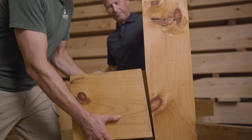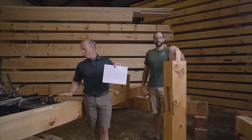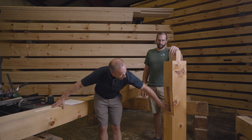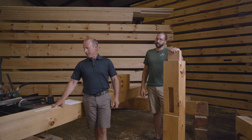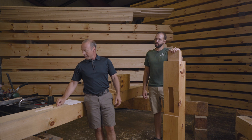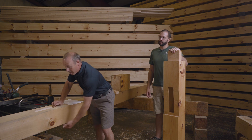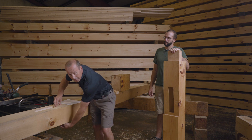With the wedge out and the tie beam out, take a look at your cut sheet to get as much out of this as possible. Gabe has already slicked the three sides of the mortise. We still need to do the slant on the bottom of the mortise and the tapered cut on the side of the post. It's very important to do the mortise bottom taper first. We have an elevation mark at 111 and a half inches — that's a critical reference for where this mortise taper should start. On the back side we have a mark at 110 inches, and we're going to connect a straight line between those two points.